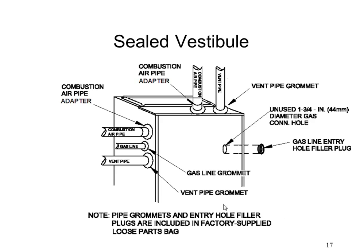Because the top half of this furnace is a sealed combustion chamber, the door is actually gasketed. When you make all your connections for vent, exhaust, gas, and electric, you need to seal those up as well, otherwise it's no longer a sealed chamber. As you make a penetration hole — say you're going to bring in your gas line — we ship a rubber grommet in the loose parts bag to seal up that penetration. Every time you bring a service into this unit, you'll be using the factory-supplied connector piece, whether a grommet or a flange.